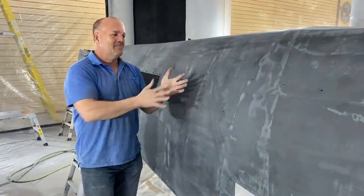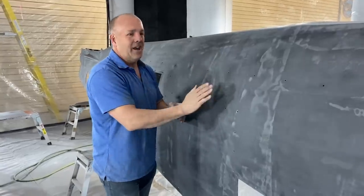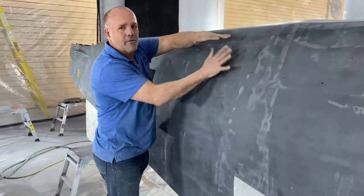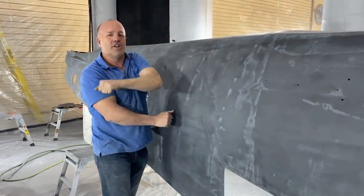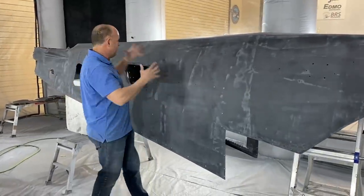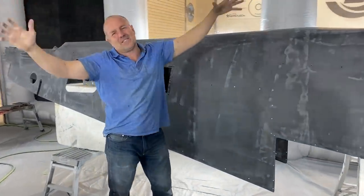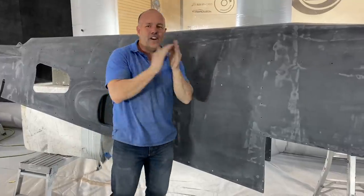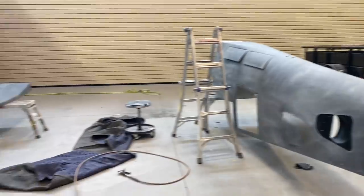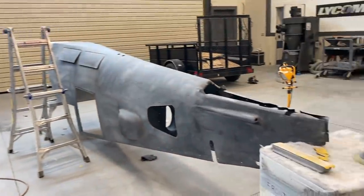I hope it does, but basically, clear carbon resin, sand it down. If I found a little low spot after I did the whole plane, I'd find a little patch, put a little more resin, put a piece of peel ply, pull it off, and use it as a body filler with clear resin. So that when I was done and we shoot it, which we're about to do right now, with the actual clear, I've filled any lows and valleys with actual carbon fiber resin, rather than building up thick paint, which won't adhere quite as well as the pure resin does.